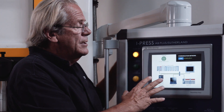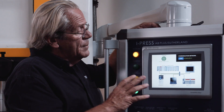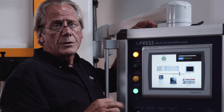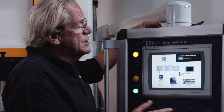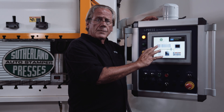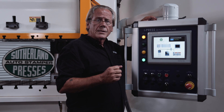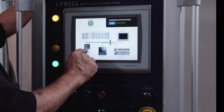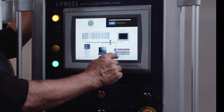Network configuration. We're using the latest in Rockwell components — the Compact GuardLogix dual safety PLC, which is ethernet connected and is part of the connected enterprise. We're using the latest PanelView screen. I'm going to show you in a minute some of the areas we're developing for onscreen maintenance and 3D drawings. Your VFD PowerFlex Rockwell drive, which the laptop was plugged in to, and the IO safety modules.